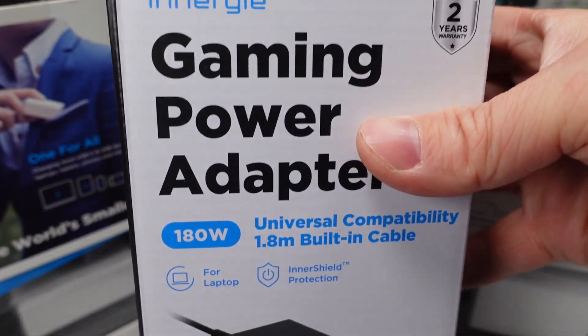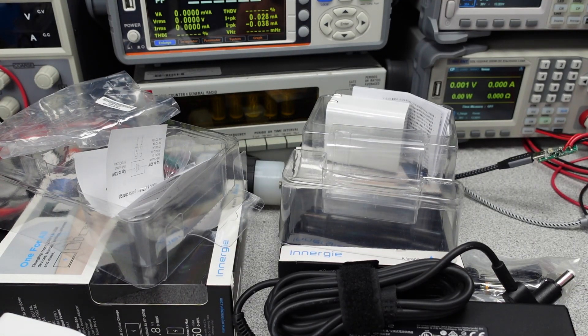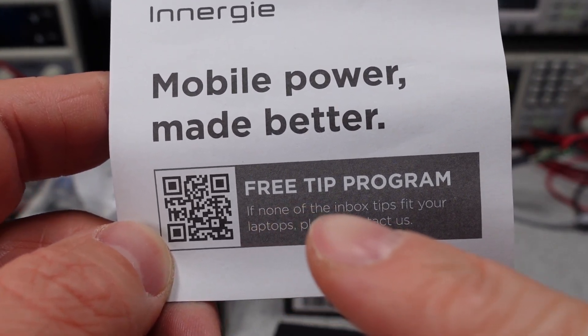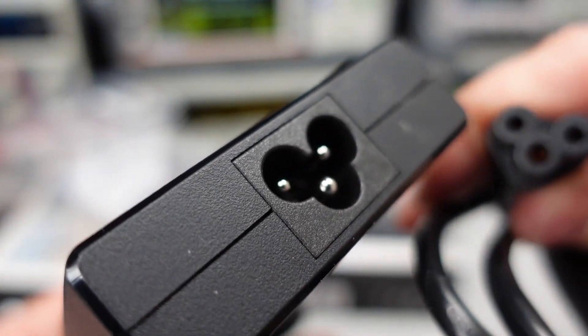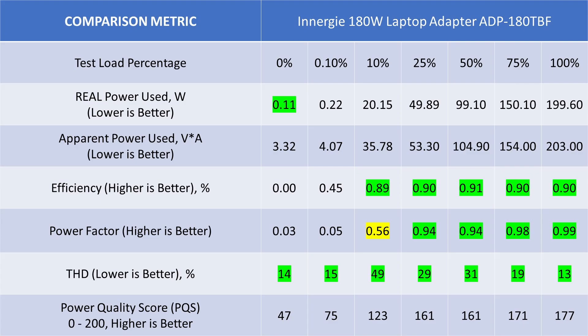On to the big one — a totally different style of adapter. This is the 180-watt Energy laptop power adapter, covering the larger side of things. Finally we see cardboard for a box, but still lots of plastic wrapping. The adapter has only one output voltage — 19.5 volts — but lots of power, and there are lots of tips for various laptops. The power cord is also interchangeable for whatever country you need. The power adapter is above the rating of my load bank for overload — I set it to 200 watts and it didn't flinch. The price is around $100, expensive but not crazy for what you are getting. Looking at the data, we finally see no red: this adapter has power factor correction, the numbers look pretty good, and even in non-PFC mode, the electrical harmonics aren't bad.